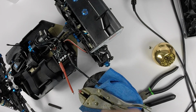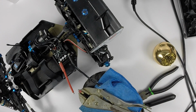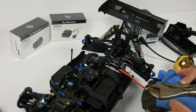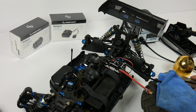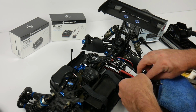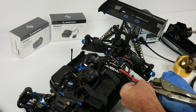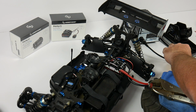Alright, so I always solder on my red terminal first, and that's always the flat one on the Deans. That's just my way of doing it. I am just somewhat religious when it comes to that stuff. You never want to solder on the wrong way. I've done that before and never want to do that again. So let's get this thing elevated up onto a platform here. Oh, that heated up fast. Have to watch yourself. You'll end up burning your hands.